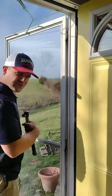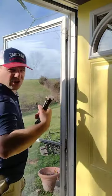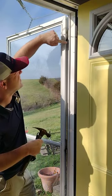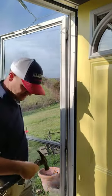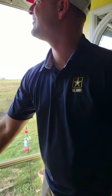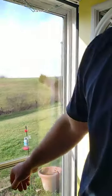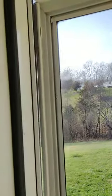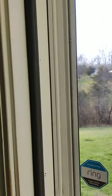When the wind pushes it, it acts like a claw hammer and pulls where this hinge is — this hinge pin — it pulls on it and makes it so that on the other side of the door it's pushed, and it hits up against there and it won't close properly.